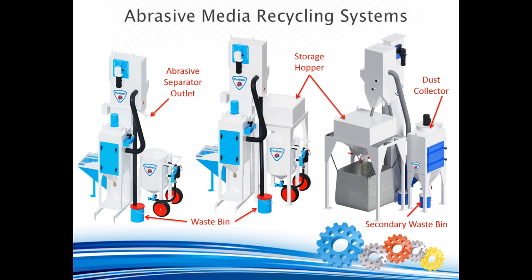Both the ProFlow 3 tons or 6,600 pounds per hour capacity and UltraFlow 7 tons or 15,400 pounds per hour capacity abrasive media recyclers can be supplied with height extensions to allow placement of a storage hopper in between the abrasive separator outlet and the blast pot or bulk bag.